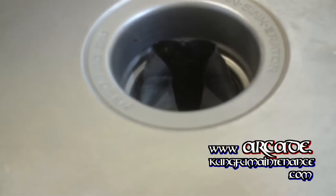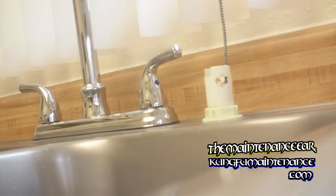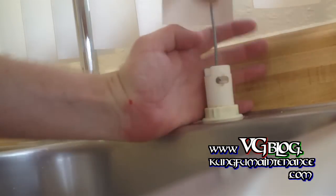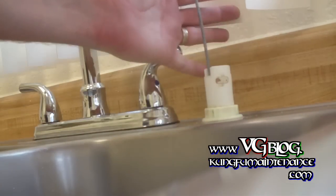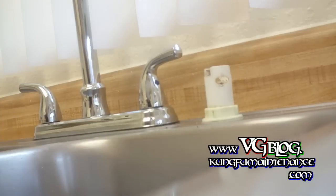Let me shed some light on it so you can see better. It's just long enough to poke into the disposal right there. Now I'm going to pull it back out — it's going to be covered with gunk. You can shield it with your hand or block it with a rag to keep this from getting all over. Pull it out nice and easy.